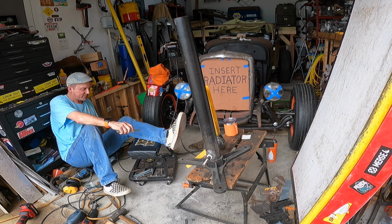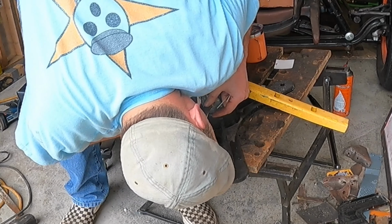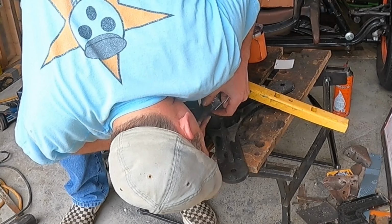Alright. Now, I left the heads on this end so I could push this together without them pushing out. So now that that's in there, we don't need these anymore. So now we gotta cut those off. Now, we can take and fill in the slots with some pieces from the other one and get it completely filled in. And I think once I get grease put in there, these will make a pretty good bearing surface or wear surface. All right, that's pretty good.